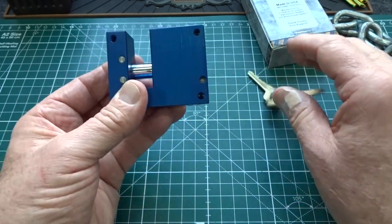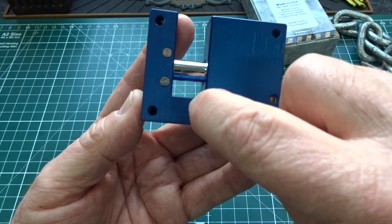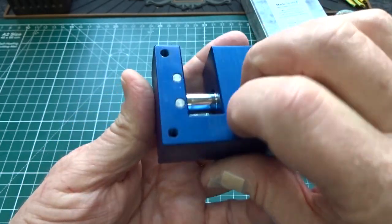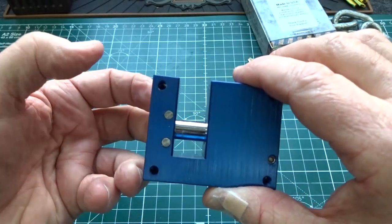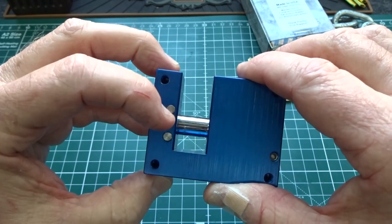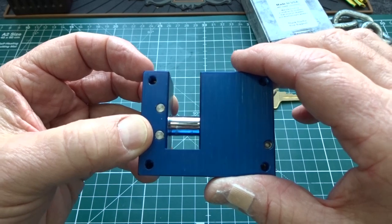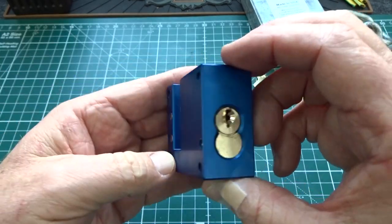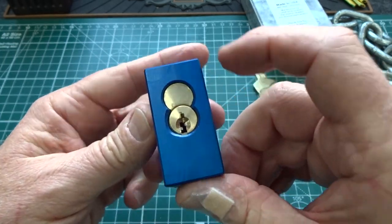The other thing I want to look at is physical attack. If I were to attack the lock, we could cut it right through here — it's aluminum, and it's quite a hefty chunk of aluminum, but we could cut right through there, rotate this part of the lock, disengage the locking wings of the shackle, and just pull it off. We're going to take a look at that too. First, though, let's attack this lock and see just how good the internal lock is.